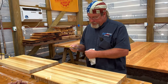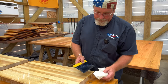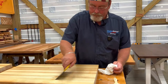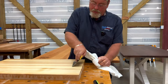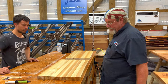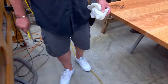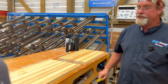I'll take a standard straight edge here — you don't have to do a lot of pressure. You can see how much extra material there is. For a lot of folks that want that real dry look but want impregnation and a seal coat, I suggest this application. That right there could constitute a very well waxed and oiled butcher block top. If you look right behind us, that's the exact look — but this has a better sheen to it. That one has three coats of oil and a coat of wax on it, and that's been replaced with one coat of Clean Armor 710 sealer system.